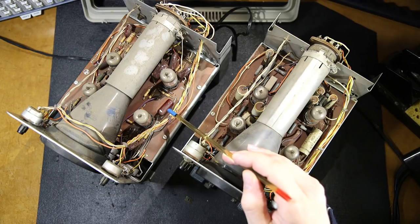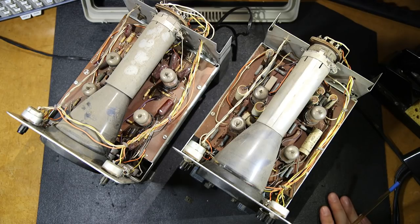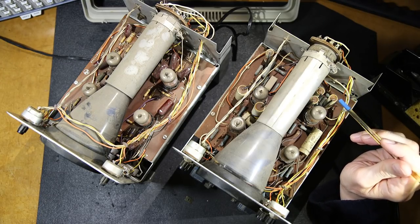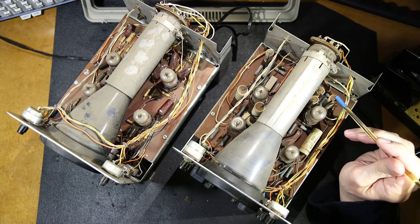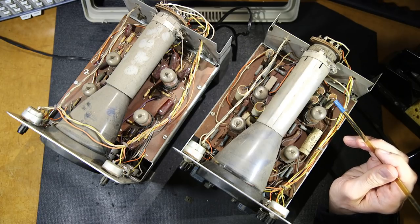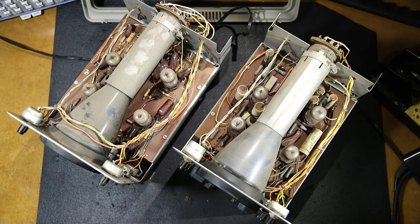The reason that they've gone with these, obviously in this unit here, is because they found that these ones here developed leakage over time and probably caused some headaches, so they just got rid of them. Now, they filled these ones here with an epoxy, but that still doesn't matter because what's inside the capacitor is still decaying, and that's what's causing that leakage. Now, again, when I say leakage, I'm talking leaking electrically, not physically. These capacitors are not supposed to pass any direct current. When they start to leak, the capacitor is actually turning into a resistor at the same time.